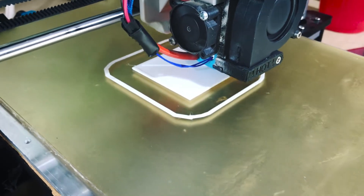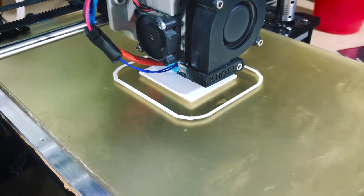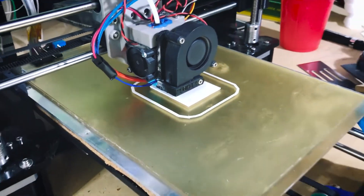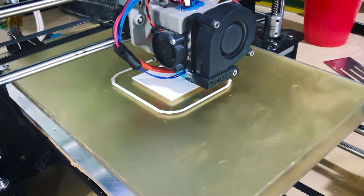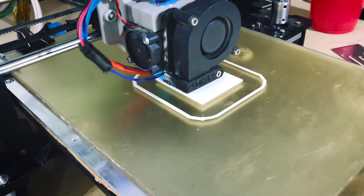With just a little bit of glue stick, I'm getting great layer adhesion, nice consistent layer lines, and I'm super happy with it. Maybe this is one way to double the life of your sheet of PEI if you're using it on your 3D printer. That's it — just a quick tip. I found it really beneficial; I can save a little bit of money, double the life of that PEI sheet, and I'm back and printing again.